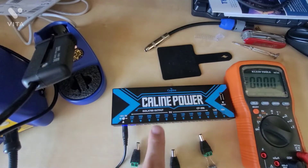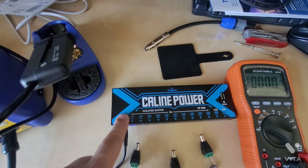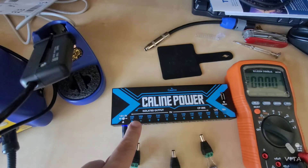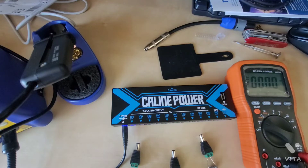There's actually a good reason for that. It's not so much the resistor values for each of these outputs — it really comes down to efficiency. You have one and a half amps at 18 volts coming in to this power brick, and then on the 9-volt lines, if we go by the nameplate rated currents, we're looking at about 2200 milliamps available at 9 volts. If you take 18 volts at 1.5 amps and cut that voltage in half to 9 volts, you get 3000 milliamps.